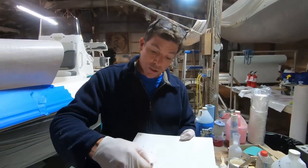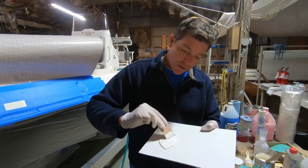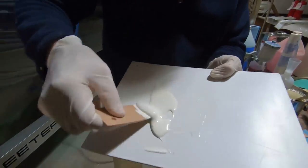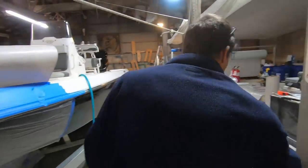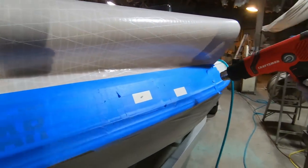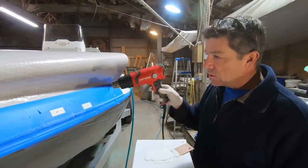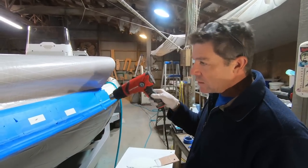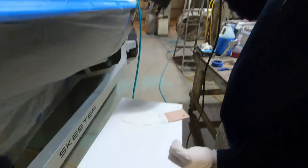I'm actually going to turn the heaters on after we get through video — they're kind of loud — but you guys can see how much time I am spending mixing that gel coat. Because the weather's a little cooler I'm going to warm this surface prior to applying the gel coat. It doesn't need to be hot but warm is good. They even make little infrared guns where you can check surface temps — I'd say 70 to 80 degrees, wouldn't really want to go any warmer than that.